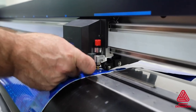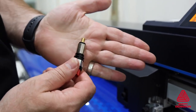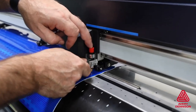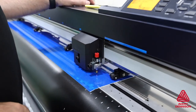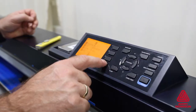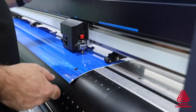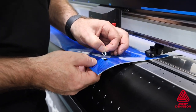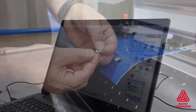It is very important to use a 60-degree blade, as this will cut through the reflective layer cleanly and precisely. The next step is to ensure that the blade depth is correct. On the first initial test, the blade depth is too deep, as it cuts through the liner and the reflective film. After several adjustments, another test is made — this time, the VisiFlex V8000 cuts cleanly and the liner is pristine.